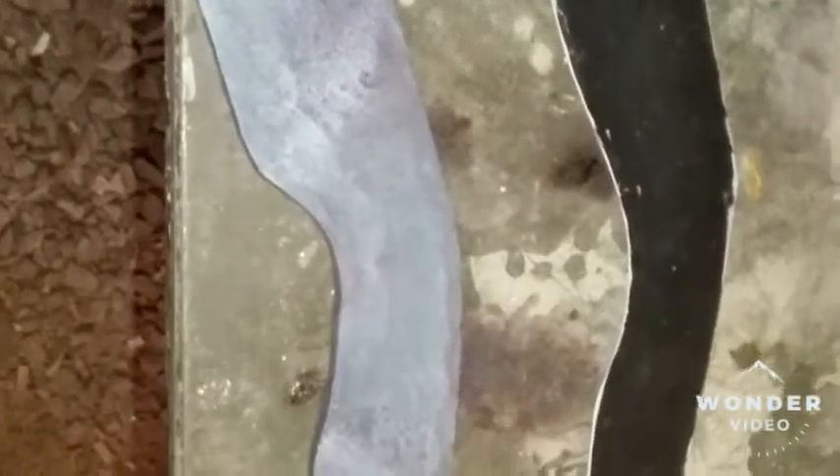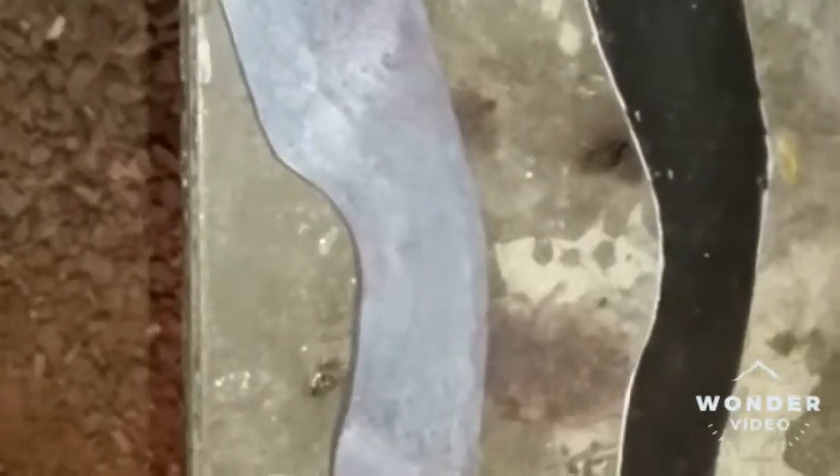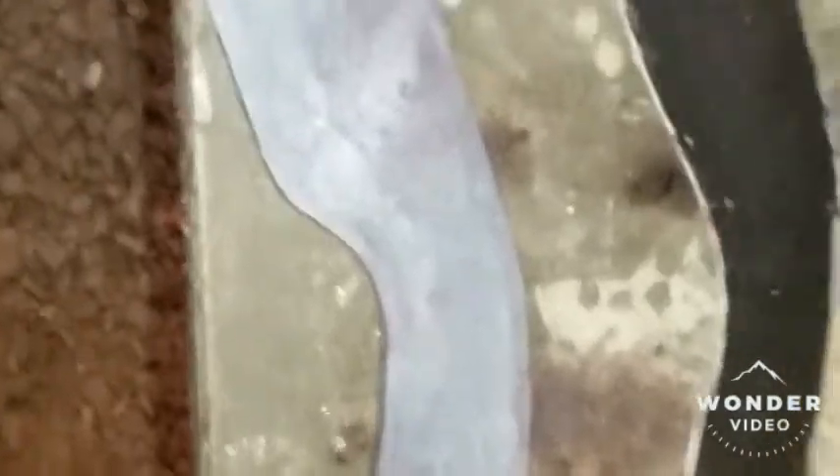I've missed video on a few steps here, but as you can see, I've got my blade pretty close to the angle that I want. I need to bend a little bit more here — I've pretty much got this completely beveled in. I need to do a little straightening and bend this back the other way. There's a little bit of a banana curve going that way, and I want to turn it the other way, so this is more like my template that I've made. That means basically flattening this and then using the horn of the anvil to pull this section down.